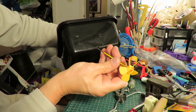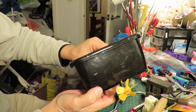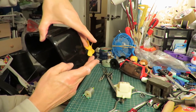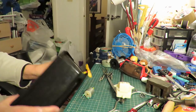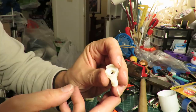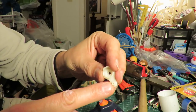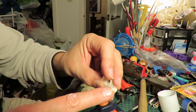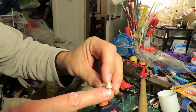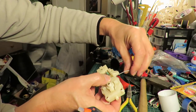I've drilled a hole in the back of there so it'll fit in there. It'll be down at quite an angle but that'll be alright - this is just for fun. And I'll build a rudder that's going to stick out far enough to miss the propeller; it's going to have to be out at quite a distance. Ideally the propeller would be further forwards but we've got a convenient gap underneath. This little bracket off the steering arm has got a hole at the middle of it - if I drill through there I should be able to push the steering push rod straight through. The other end of that will be pushing the rudder.